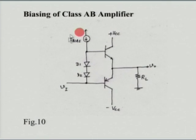We also talked about a scheme very commonly used in ICs, where you choose a current based on the voltage you require, and by changing the current you could choose any value of voltage. This has another big plus point. One of the minus points in a power amplifier is the heat generated, and we know that the VBE voltage is highly sensitive to temperature. Because the biasing scheme also uses semiconductor devices, they all change together. If they have a negative temperature coefficient, they will change together, therefore we will not have thermal runaway. So, this kind of scheme is generally used to ensure that you do not get thermal runaway even when there is heat. Then finally, we talked about power BJTs.